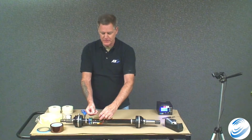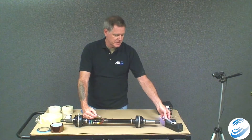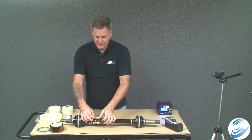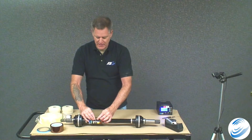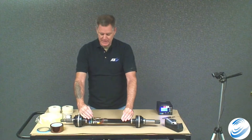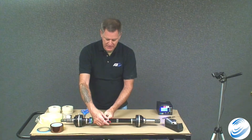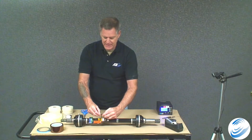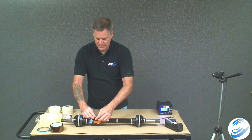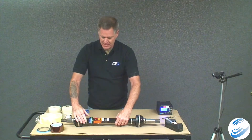Connect the transmitter to the strain gauge wires — the connector comes together and stays very firmly. For a little extra protection, place a small piece of tape over that connector. Take the wires and place them between the transmitter and the battery, pressing them into the double-sided tape to hold them until the other protective tape layers are applied. If they don't stay put, tape them in place. Then connect the battery connector firmly together and place those wires into the tape as well — no need to tape that connector since it clicks firmly.